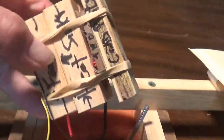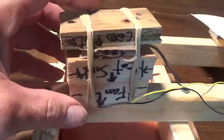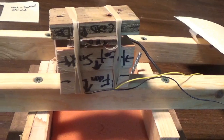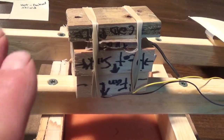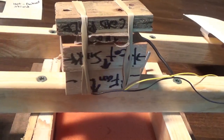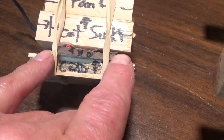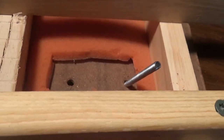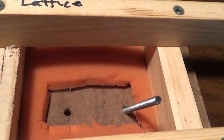And if we turn it upside down, this is the cold plate, the cold spacer, the thermoelectric. Air comes in this way, sucks down, and then exhausts out this way. And we made the heat sink and cold spacer and fan larger than the thermoelectric module, which is 1.5 inches, so that we can bolt this whole stack together onto the cold plate, so it sandwiches together. Good thermal conduction for all the pieces.